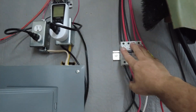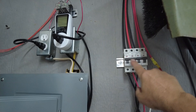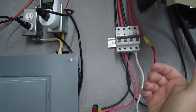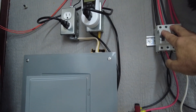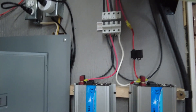Next time, I'm going to put a breaker over here — I actually have another breaker and a longer DIN rail. When I want to throw all the voltage into the Growatt, I'll just turn these off so nothing goes to the grid ties unexpectedly. Before, it was just on a fuse so I'd have to climb up to pull it; now I'll put it on a switch right here. That way I throw these off, then throw all the voltage at the Growatt. I'm also going to see if I can get a replacement capacitor — my hopes aren't too high since there could be something else burned out in there too.